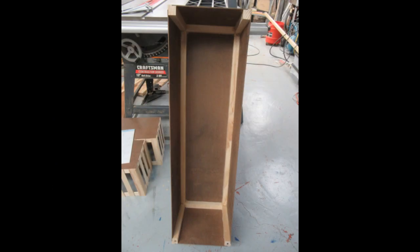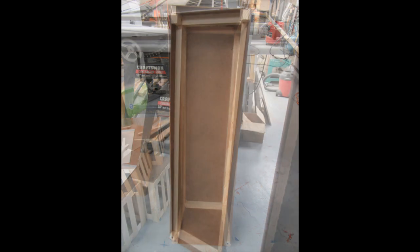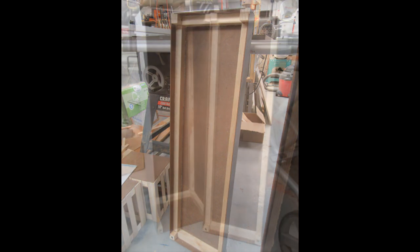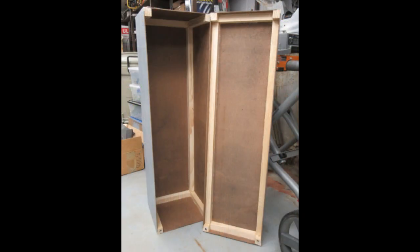Most of the woodworking is done at this point — there's just some wood trim and some reinforcements that still need to be done. Now that the case is cleaned up, it's time to reinforce the edges. The masonite isn't strong enough along the cut edges — it would rapidly break — so it needs to have something along there to make it stronger. Also, the reinforcement needs to be thick enough that it'll take screws for the valence, which will be added later, and the valence adds additional strength to the long sides.